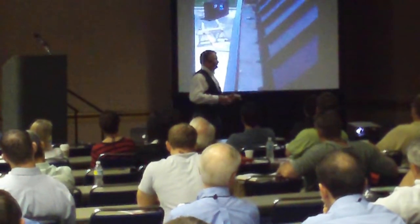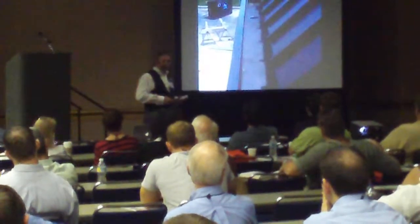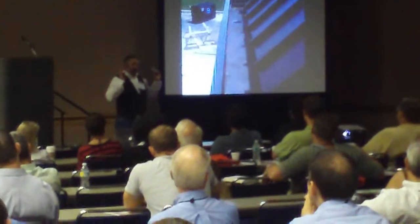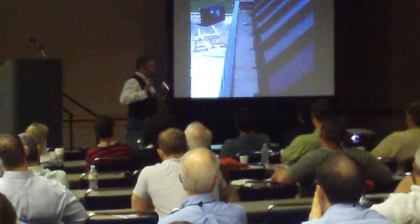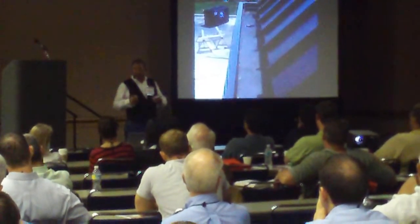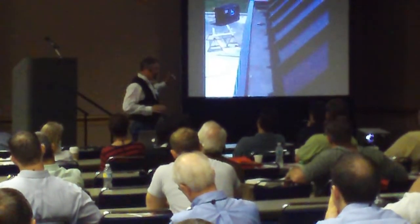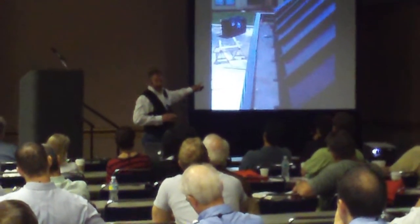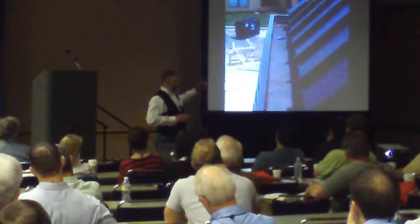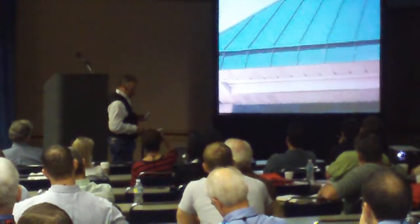As badly as I don't like built-in gutters, this is the best way that I know to do them. And it's not metal — unless you're going to get really carried away with soldered seam copper and so on, I do not recommend building these gutters with sheet metal linings. Put an EPDM lining in there and be done with it. Much better way to go.